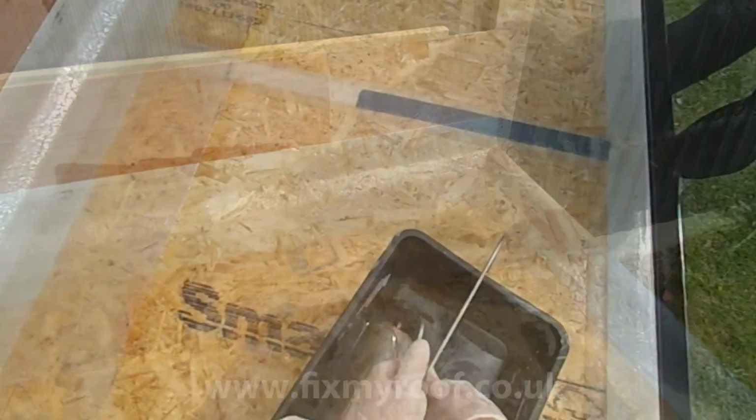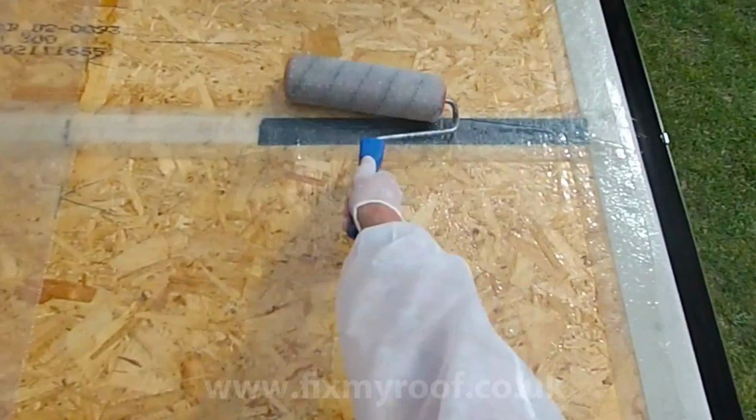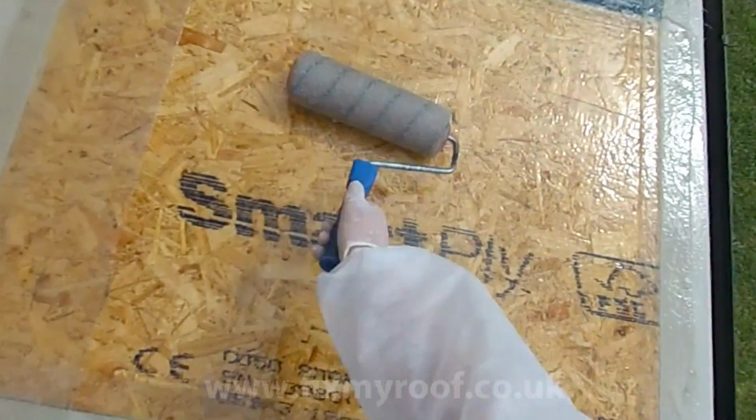Now I'm going to wet out the remaining roof deck, and it's much easier to laminate large areas than it is with the small details. Get enough resin on so that roof looks comfortably wet without puddles of resin all in one place.